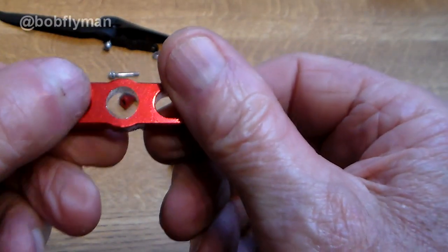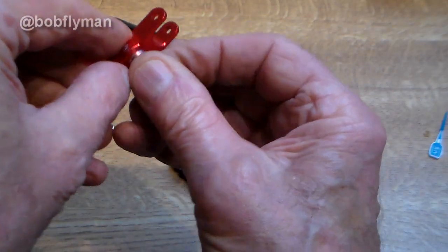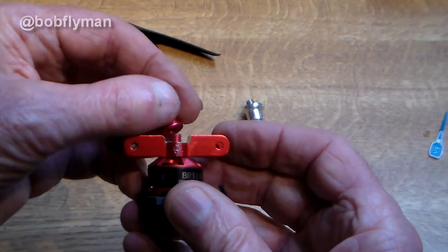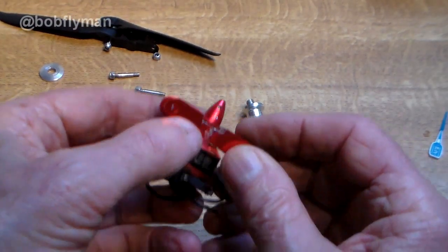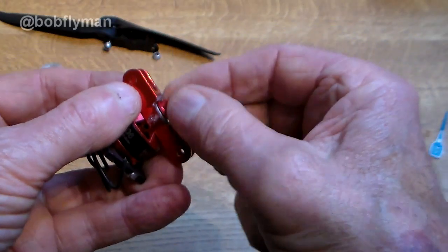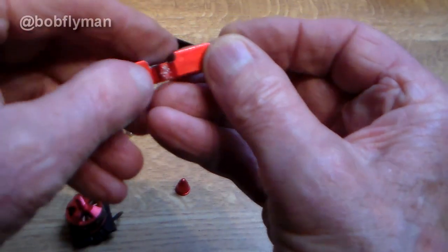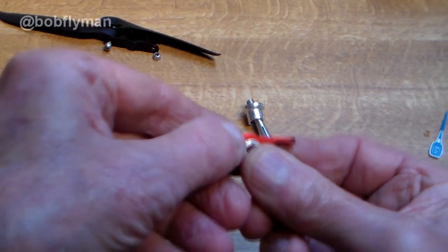After a bit of filing it doesn't look too scruffy - just a bit of marks where it was held in the vice jaws. The bush goes in nicely and that will fit nicely on there. I think that's deep enough for it to hold, but it might need to just take a little tiny whisker off - it seats on the edge of this. The hole idea worked, I just went a bit deep with the filing. If I'd come up another fraction of a millimeter that would have been okay.